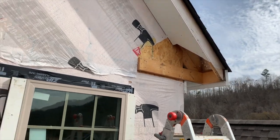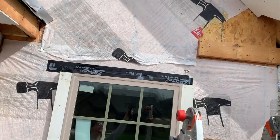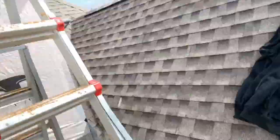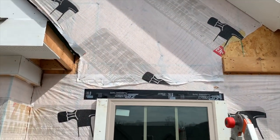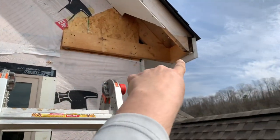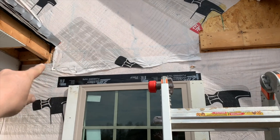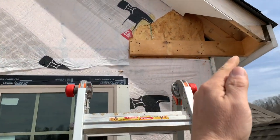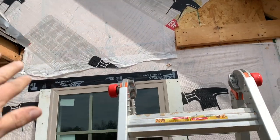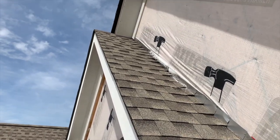Stay tuned, guys. I've got this thing all the way ripped off. It's hard for me to get the perfect view because I'm standing up here on the front porch roof, one more step and I'd be on the lower porch. I just cut my 2x6 sub fascia. I'm going to run it from right over here all the way across to that barge rafter. We'll put the sub fascia on, put a board right across there on the wall, block that in all the way down through there, put our little rafters up, put our plywood on, and we'll be able to tie that roofing right in and lace it on up that roof.